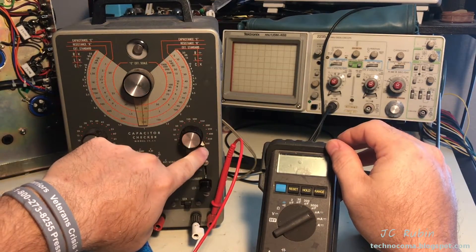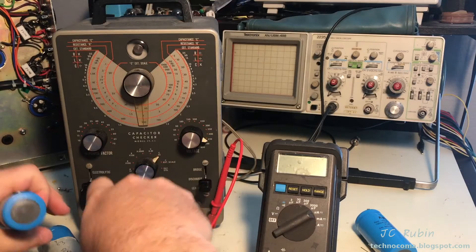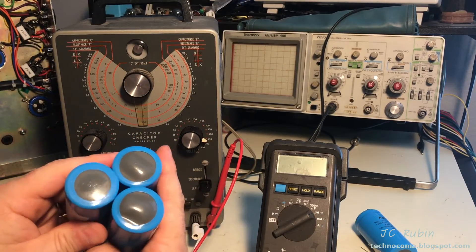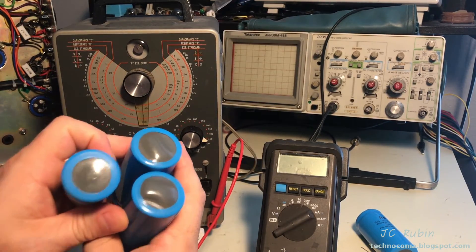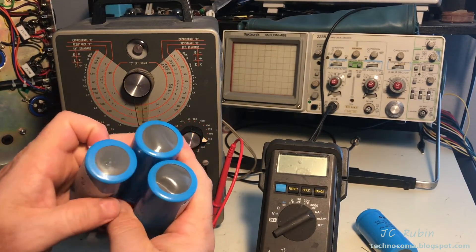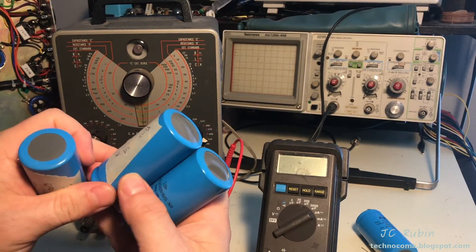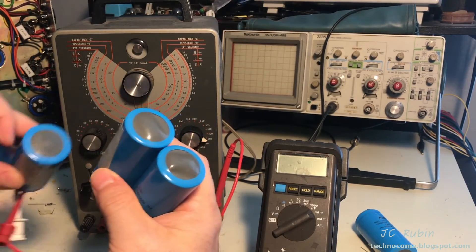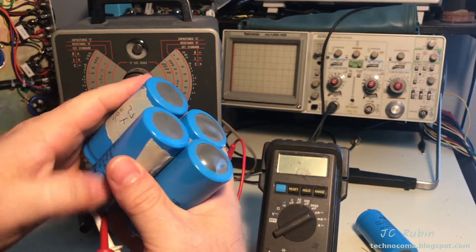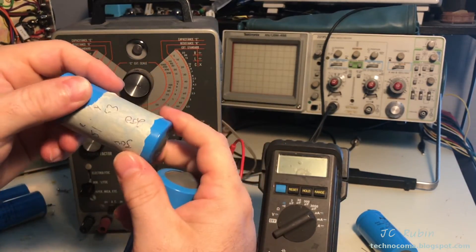Given an hour or two they would get up to about 400 or 450 volts. What I think is that this amplifier sat for an extremely long amount of time unused, and these capacitors were completely broken down. When the amplifier was fired up, a ton of current went through them and caused them to boil over. I think several fuses were blown and they just got worse and worse, hotter and hotter. Because this was a short event, the capacitance still read good when I inspected them.